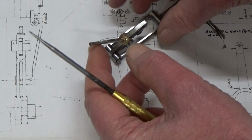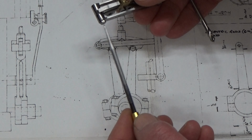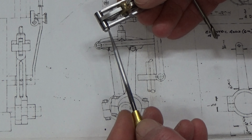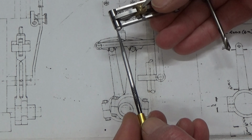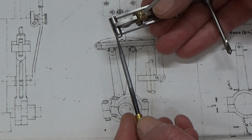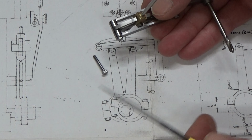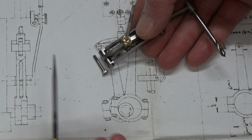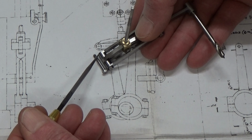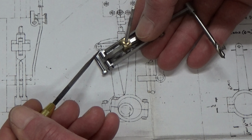The only issue I've had is with the bolts putting it all together. These, as supplied in the kit, are undersized. These actual bolts are for some other part of the engine, but I just tried them and they're absolutely fine. It's a plain section. I'll show you one of the wrong ones. They go like that. As a plain section goes through two parts, and in my case, it's threaded in the rear part, with provision for a lock nut on the back.